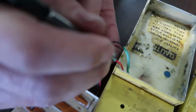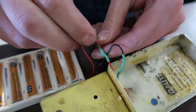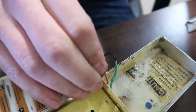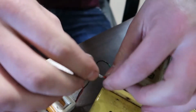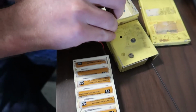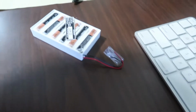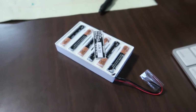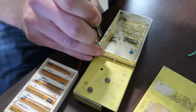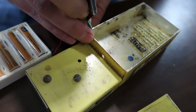What are we doing right here? Well, we're going to dissect this solder joint and unsolder it and solder the new battery pack in for this little old ELT here. Emergency locator transmitter. It don't transmit your location, it's just a beacon. Pew, pew, pew. We got the new battery pack right there. Solder that. Try not to stick this razor blade in there. Yeah, don't stick that razor through your finger. Oh, it would be so good. Do what? It would hurt so good.